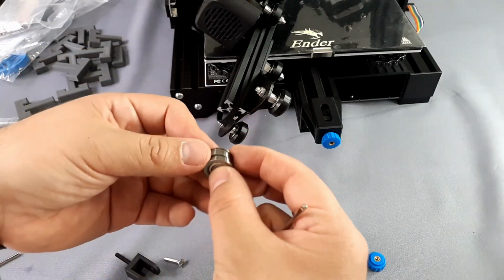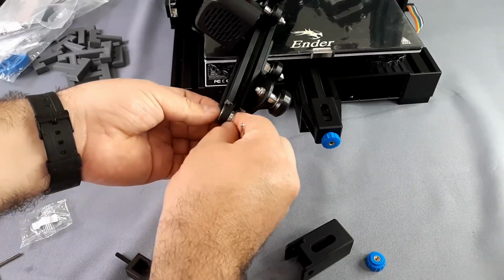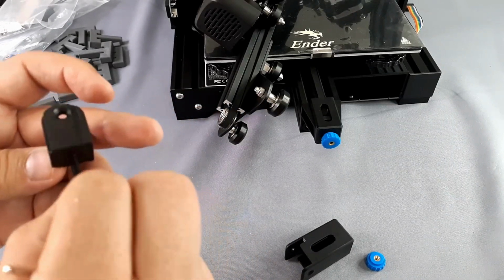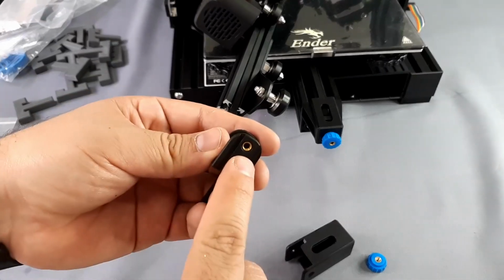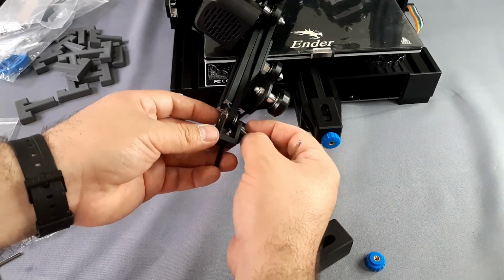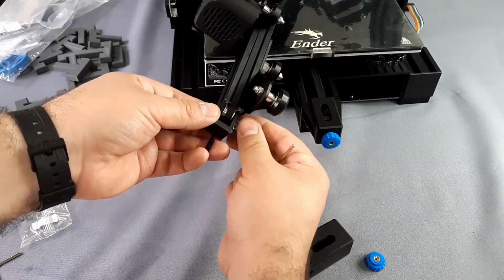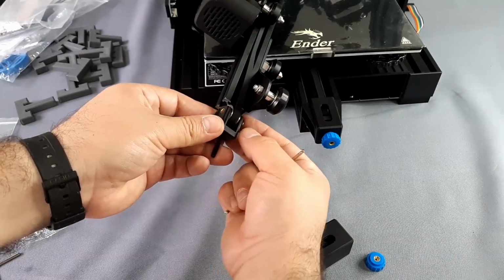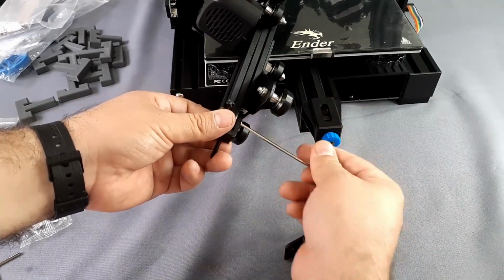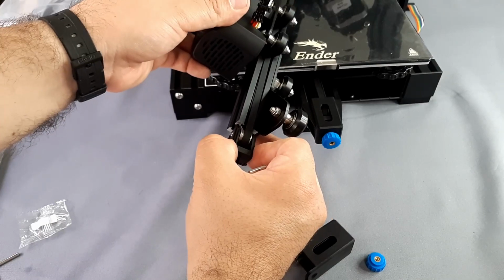Pull the band and place the 2 bearings. Locate the thread of the fastening. It must be on the front side. Align it with the bearings and screw it. Check rotation of the band.